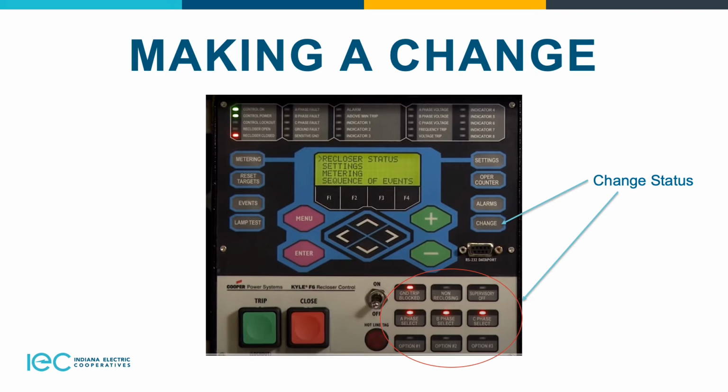The control setup, you have to do it via SCADA back. So the phase A, B, and C, that's for your triple singles. So you can close in, open one single pole at a time, whatever you want to do there. Option 1, 2, and 3 are function keys that you can enable. You can turn it into a switch mode, which enables the control to turn into basically a switch with no functions. Your source for your loop feeding, whatever you would like to have there.